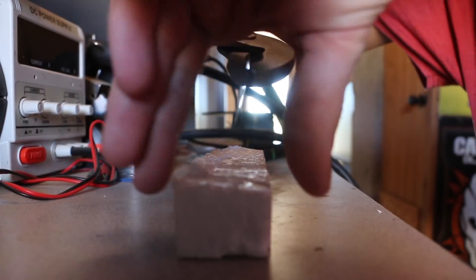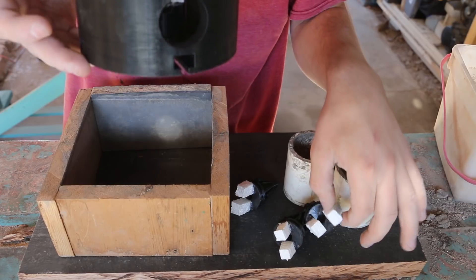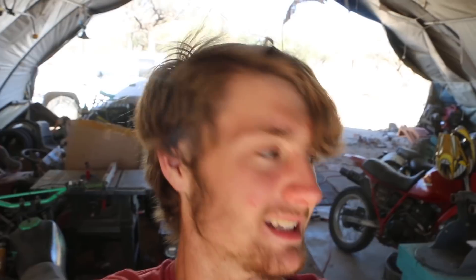I have re-3D printed the pieces. I'm going to cut little pieces of styrofoam and glue those onto there to make the shoots — some to act as air vents, some to act as the actual pouring vents. I'm hoping this will work a lot better. Also these pinions I'm going to cast this way, facing up like this and out. Pouring the larger casing the same way as last time, but I'm going to heat up the aluminum even hotter. So I'm on to building the molds around these pieces so I can cast them. Let's get started.